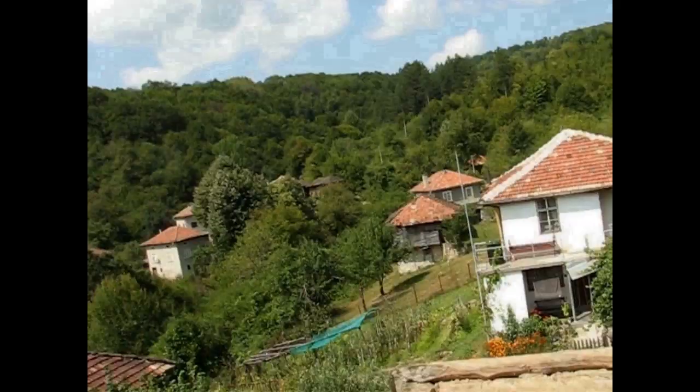Basically, it's the hips that always leak, and the ridges, because when you're making a slate roof, and these huge stones all come together, you can kind of figure it out on the slope as it goes down. But where you have corners, there's no ridge caps. There wasn't ridge caps made for such huge ridges, you know. And that's where all the leaks would form. And there you go. Here, so this is a classic.